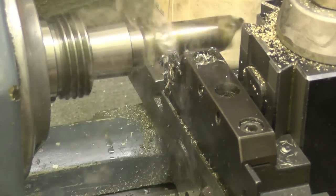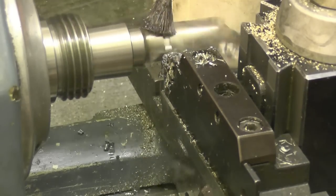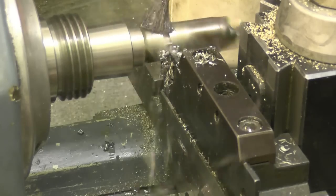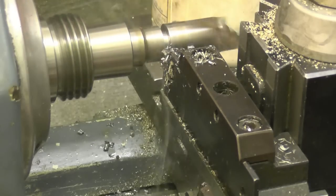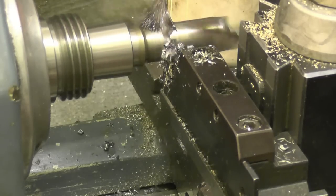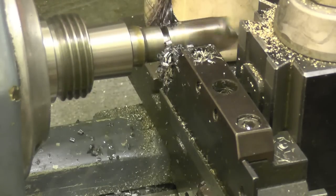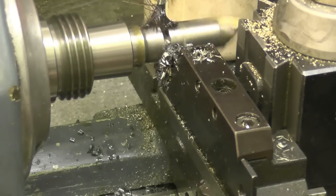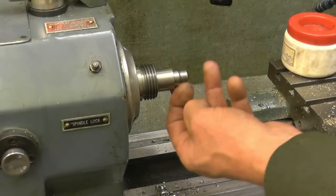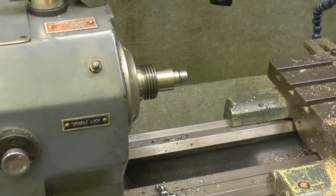As you can see, it's not that hard — you need to follow it in steel as well. You want to keep all your old broken Morse taper drills and attachments. That bit of steel is the same material the actual cutting edge of the drill is made from, so obviously you can harden and temper it.